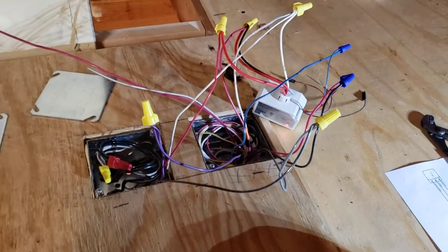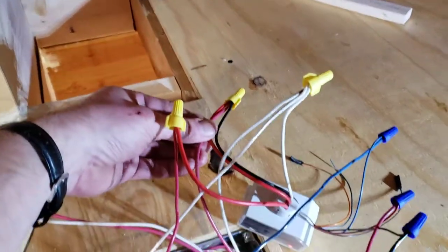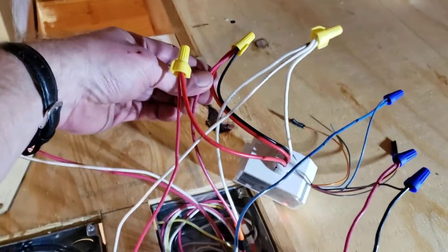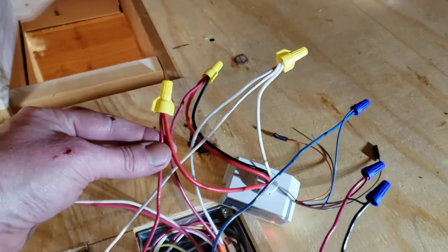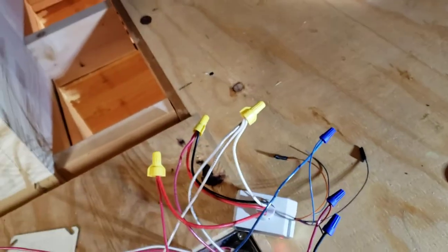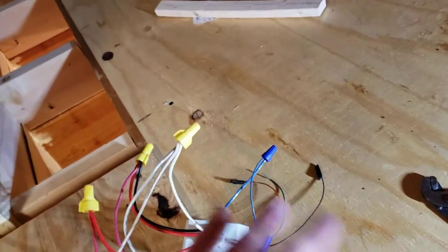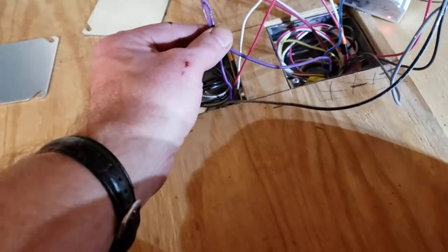On this unit, the power pack — you string one of the reds and the black to the hot, and you tie the neutrals together. This is the pass-through wire that will go to the 110V on the fixtures. All these other leads are low voltage leads.